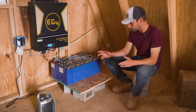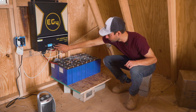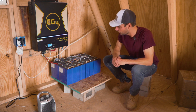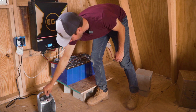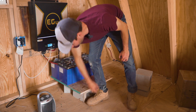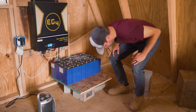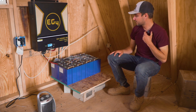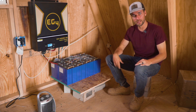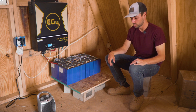Inverter-wise, if I switch it on it shows some nice lights, 120 volts output, circuit breaker on — turn on this 1500-watt load and we get hot air, so everything's working. I'll pretty this system up a bit, especially before it gets inspected for code, but that won't be until we're pretty much framed up with the house, which is still a ways off.